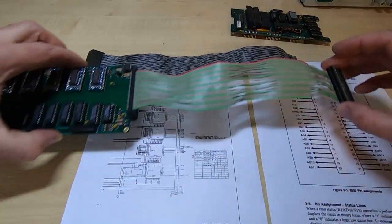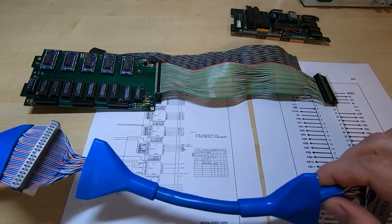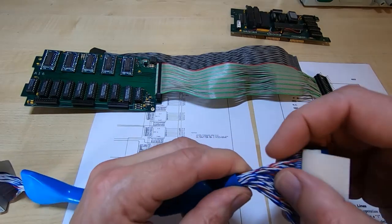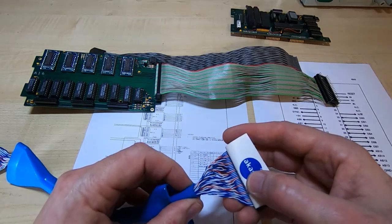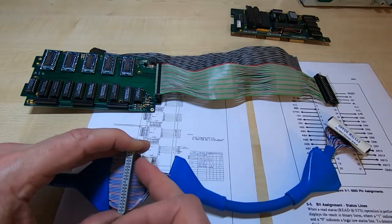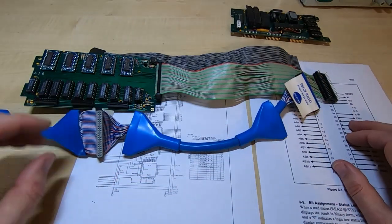So that's essentially how you make the cable. You can also use cables like this — again off a PC, usually used in a server — it's exactly the same as a standard IDE cable in terms of its connections, except the centre portion has been created from twisted pairs, so each pair of conductors is twisted, giving far more noise immunity. It's not really necessary, but if you want a belt-and-braces approach, you can do that. All you do is cut off the shrouds, cut off one end, connect it exactly as we did with this one, and you have a very nice, small, flexible cable. There's nothing difficult in doing them.